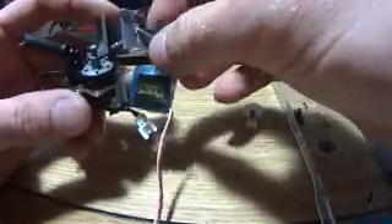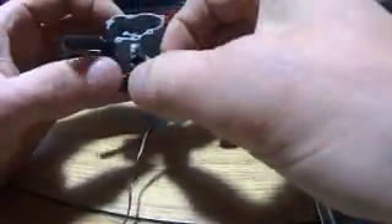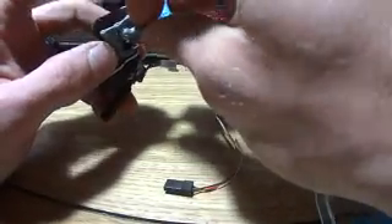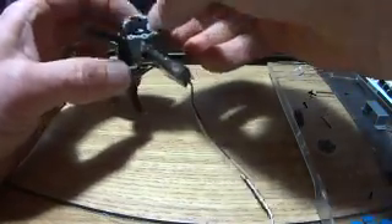With this housing, I'll have to feed the shift fork through there — it's kind of all goes in there kind of tight. But this goes in here like that and then this kind of snaps in here. It's pretty tough stuff. I used PLA to print this. I hadn't really used PLA before; I was mainly using ABS, and I'm really impressed with it. But it does melt at a lower temperature, which is great for printing — gets you up and going faster between prints. And it's a little bit more rigid, so for this it worked out really well.